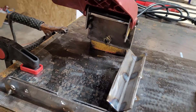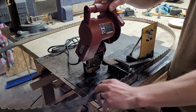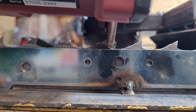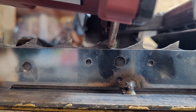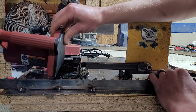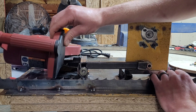That's locked in place. Let me get a blade thrown up on here. It looks like I need to go a little bit more of an angle to match what this blade is at, so I'll make that adjustment. That looks good, I'll snug that up. I'm going to go to the absolute max position, which would be the very top of the tooth right there, and then go a little bit more.